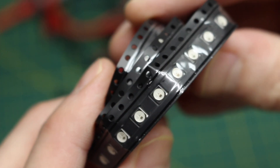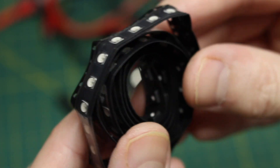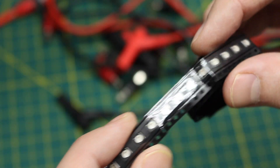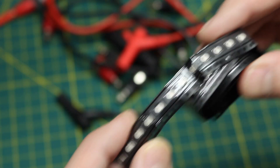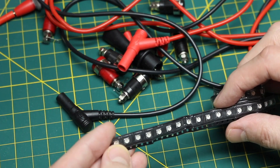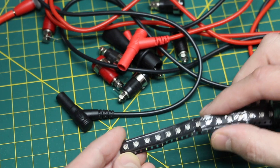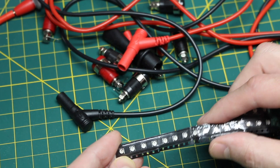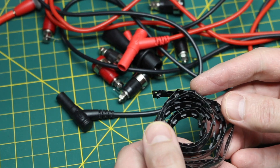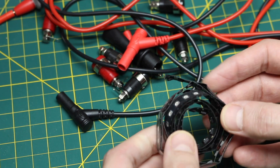I ordered this a long time ago, a couple of years ago: addressable LEDs, SK6812, 3.5 by 3.5 millimeters. Being smaller than the typical 5 by 5 millimeter LED strip, I wanted something a little more compact. I have a PCB project where I want eight of these on the board. I still have to do some experimenting to make sure I know how to drive these, but I ordered them just in case, and now I finally have a project to use them.